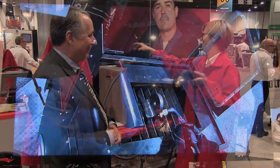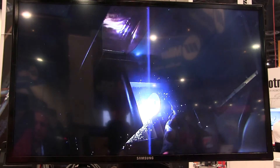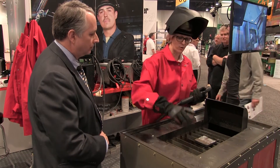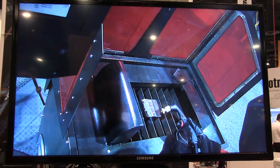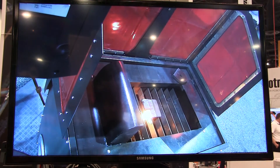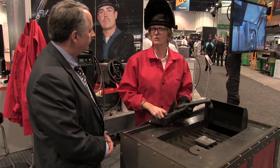Let's see it in action. Okay, let's do it. What I just did was cutting with flush cut consumables. Our flush cut consumables offer two operations in one set of consumables at one mode. I first started at 105 amps in cutting mode and quickly cut the lug vertical base. Then I drop the amperage to slowly flush the remaining material, leaving just enough so they can grind the balance. The goal is to maintain the base — we do not want to touch it — and it's a very fast process done in one operation.